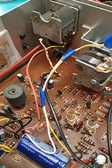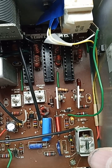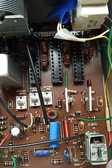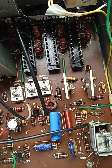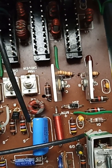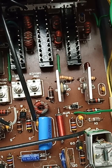To the part of Heathkit lying about 3 watts: I always wondered why I couldn't make contacts on this thing with a dipole. I never had enough transmit power to operate the cheap SWR meter I had, so I couldn't match the antenna — and it was probably way out of match. When I restored it, I got looking at the final circuit. Those two transistors are good for 20 watts dissipation, so this rig ought to easily put out 10 watts. The problem is they left out the driver stage — went from the mixer through a transformer into the bases of the two transistors. The thing was transmitting three-fourths of a watt, not three watts. There's no way to fix it without adding a driver stage.